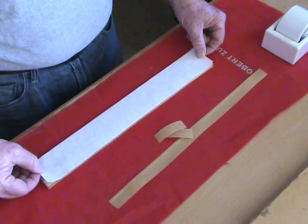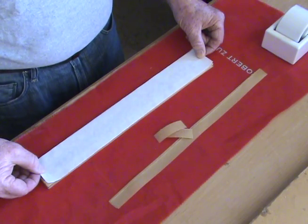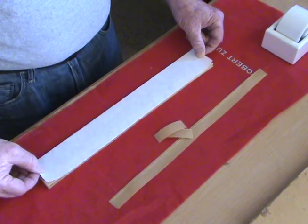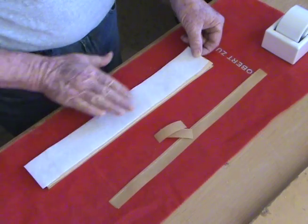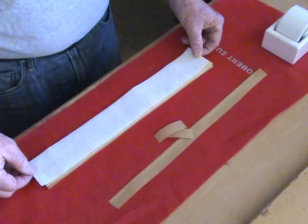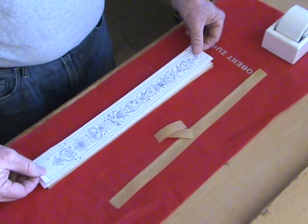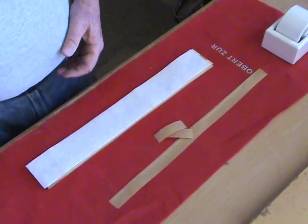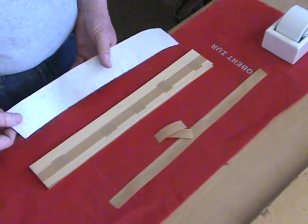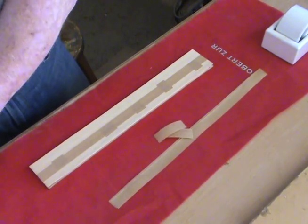Most of the texts don't call for this, but I do that, and I glue that on this particular surface so I don't have any waving stuff going on whenever I do my cutting. And then on top of that is where I will put the pattern itself. That seems to give some stability to this top backer board piece whenever you're cutting very fine areas.